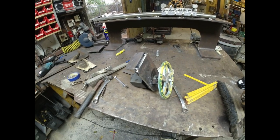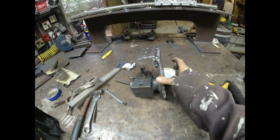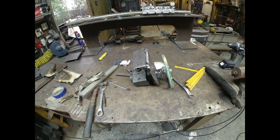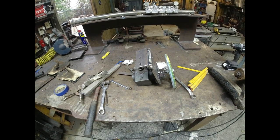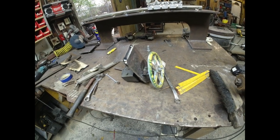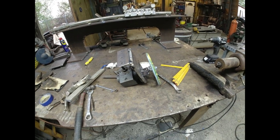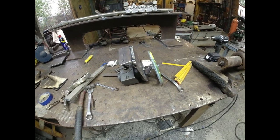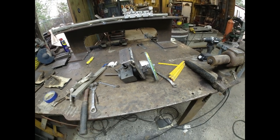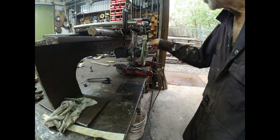So I was able to use one of my angles from my botched top thing, whatever you call it, and I got it tacked on there, and I'm always conscious of putting welds where I can cut them off easily, since this is designing in 3 dimensions with welds instead of on paper. And I got a hand wheel on there. It doesn't have a keyway. It's just relying on the friction of the 2 nuts, so I'll have to do something better eventually, but for now it's good enough. Of course, the knob's pretty cute, huh?